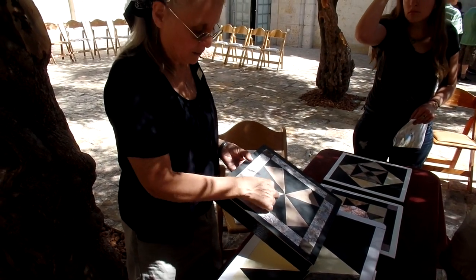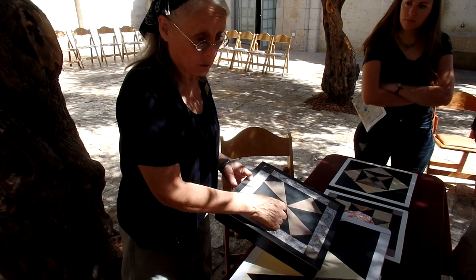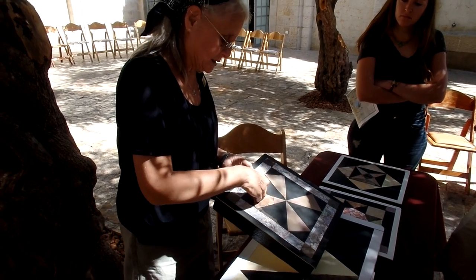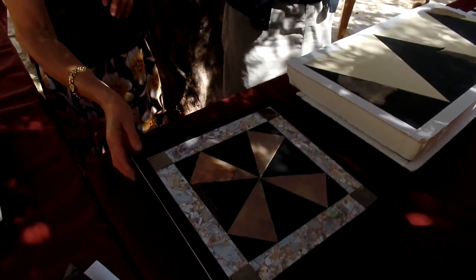It accounts for the fact that I had this crazy thing here with 38 degrees, and I'm going, what in the world do you do with the 38 degree? And the answer is, well, because this is 52. The 52 and 38 is 90, so you're back to a square corner again. So wherever he used this is right next to one of these kind of triangles in order to make it fit.